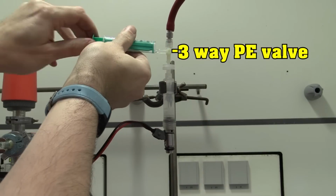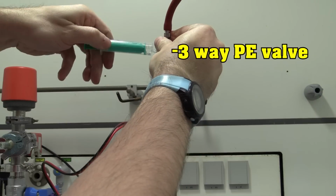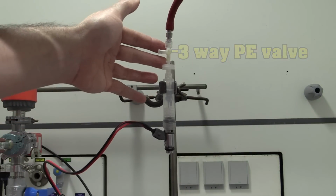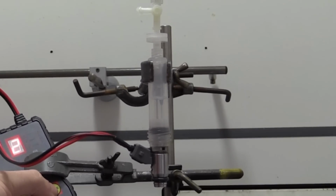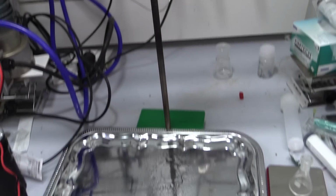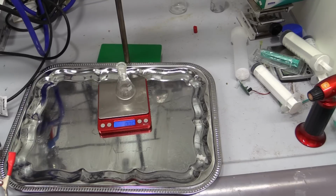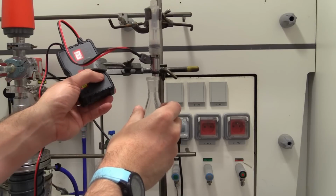Okay, that works. And we've got built up pressure on there, so let's just relieve that. Good. There is about 5 atmospheres of pressure on the top line here. Now when I hit the pulse button, most of that spray just makes it straight down to the bottom there as a big puddle. I'm going to tare it at zero, give it a pulse like this,